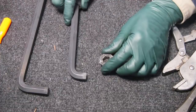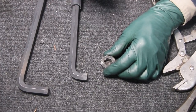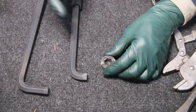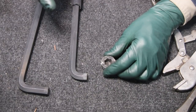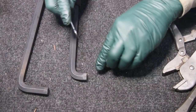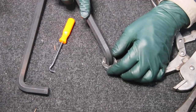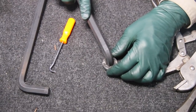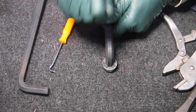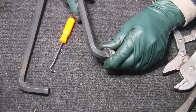In review: the keys are, on any hex bolts, plugs, or screws, to clean the area out with a pick tool first — get all the crud out. Then when you insert the hex tool, if it doesn't feel like it's going all the way down to the bottom, get a hammer and tap it in before you apply any torque.